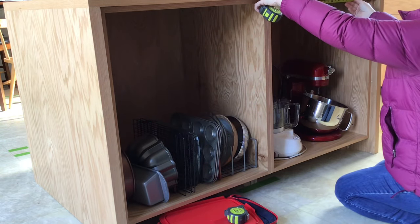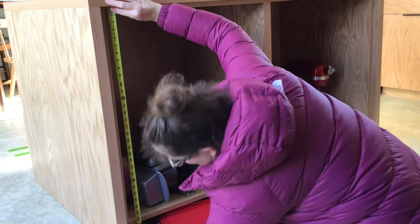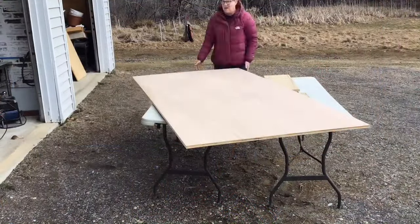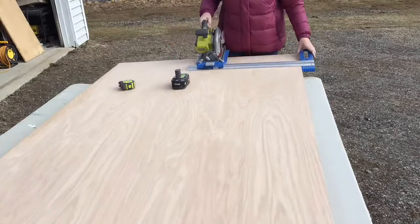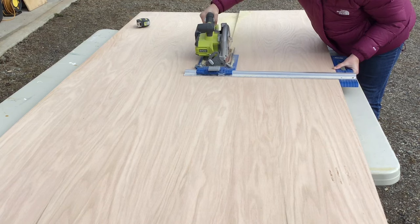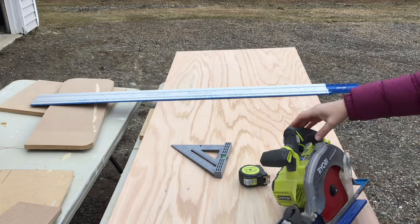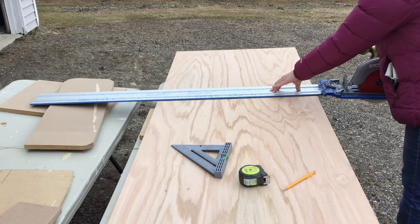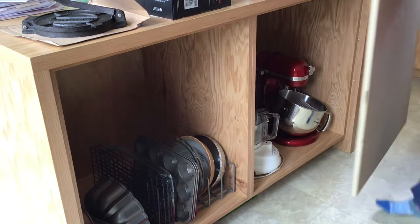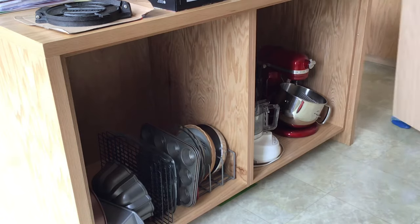First, I measured for my cabinet doors. These are frameless cabinets, so I measured the length and width of each cabinet front and subtracted 1/4 inch from each measurement to get the dimensions I need to cut my wood. Next, I used my Kreg Jig Rip Cut Saw Guide and Circular Saw to cut 3/4 inch red oak pure bond plywood to the width of the cabinet doors, then used my Kreg Accu-Cut and Circular Saw to cut that piece of wood to the lengths I needed. I decided it made more sense to have two doors on each cabinet since they open in between the island and a run of cabinets, so I cut the pieces of plywood in two.